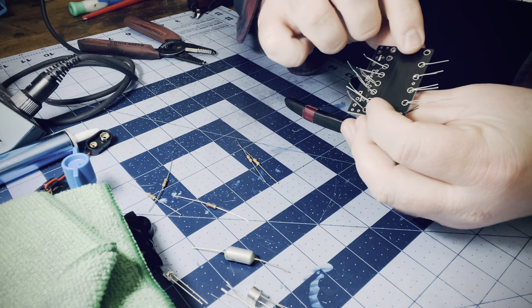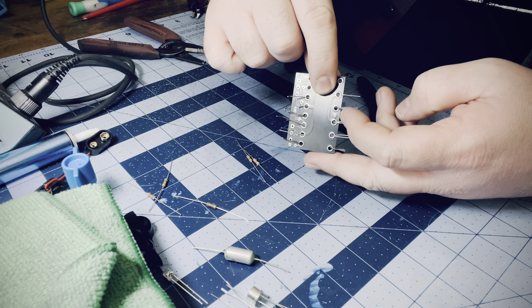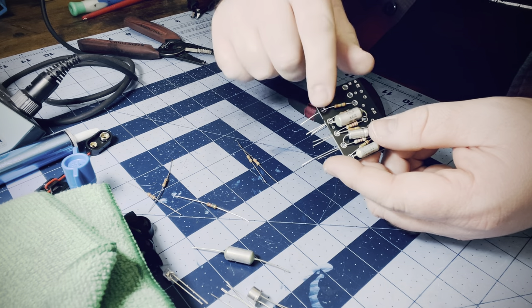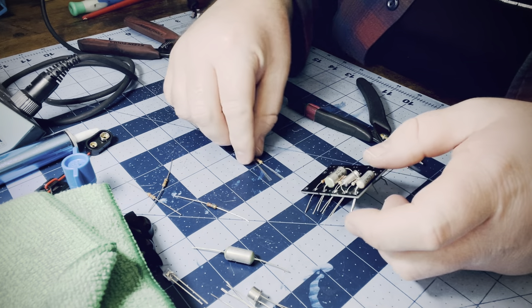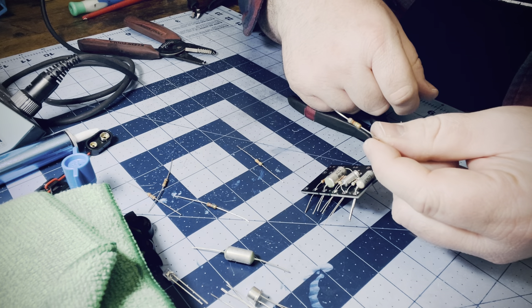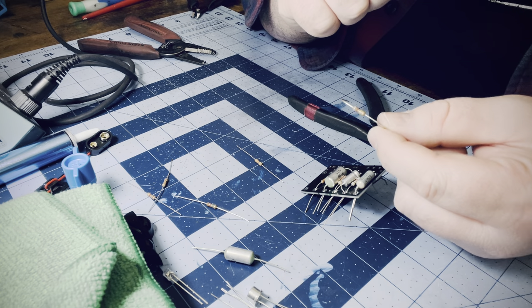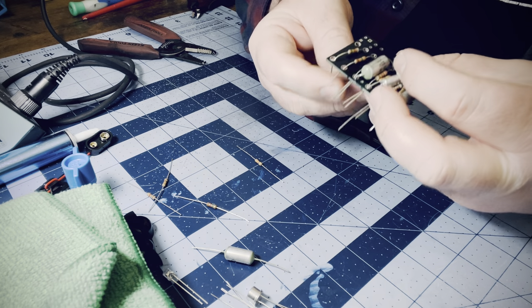That's coming off of power — on the back there, that trace hooks up the power, and that little solder pad in the middle, a wire will go to the power jack on the pedal. That biases Q3, going to the collector of Q3 in this pad down here. The next one is our output resistor. I've talked about this before on several of the Mark One videos, but I make these smaller — this is 820K. The stock value is 2.2 megohms, but I just like this better. The signal flow kind of meets up here and then splits off.